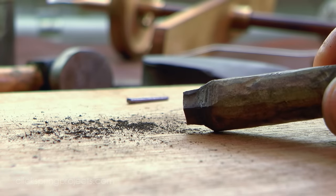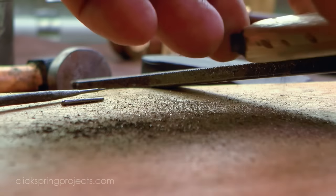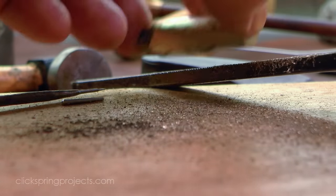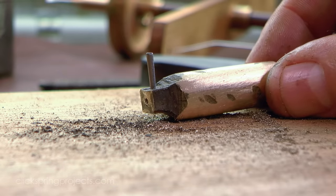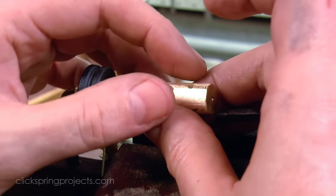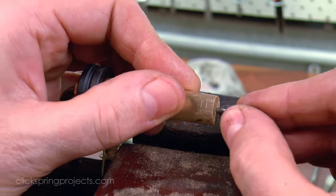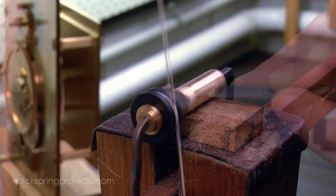So now, in addition to the direct drive method shown previously, we now also have an indirect alternative that can be used, depending on the workpiece requirements. In each case, catching the driving force however best suits the occasion, while still making use of the core features of the bow lathe. Two pivots, a rotational force, a tool rest, and a cutter.